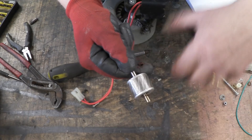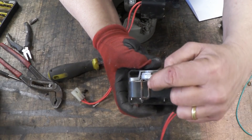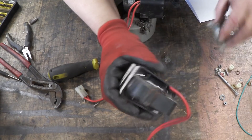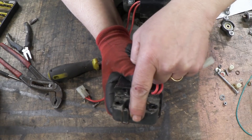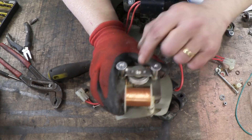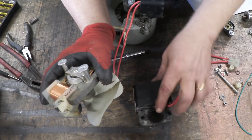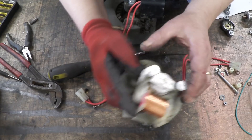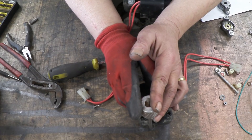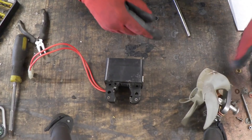The aluminium lines join up on these two aluminium plates, and that's where the induction circuit is - between two of those lines and that plate. That sets up the alternate field. We can also see the shaded pole right there, which helps create the rotating magnetic field. The plan is to chop through here and here, remove those thin pieces of metal, stick a couple of magnets here and here, and cut the rotor into a bar shape.